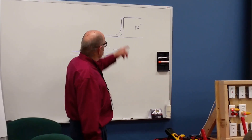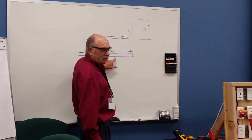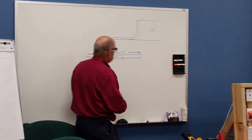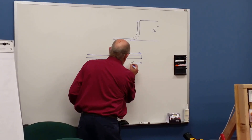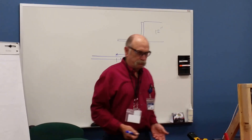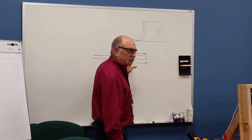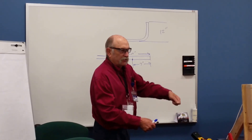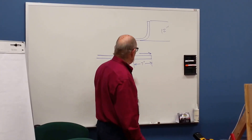So, like I said, we'll do that right away, and you might find out — wow, we put that mark here. What else could we do? You could just put a mark here at 7, right? So in actuality, after you bend for a while, you're not going to be putting a mark back here and putting a mark here. You might just put a mark here, you might just hold it in the bender and measure it right there, and not even have to put a mark on the pipe. But for now, we're going to mark the pipe.